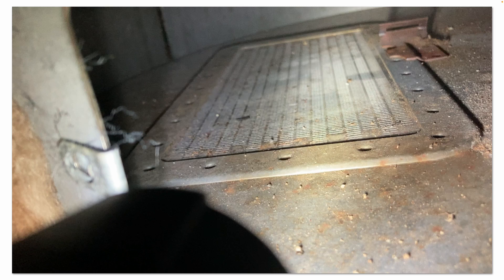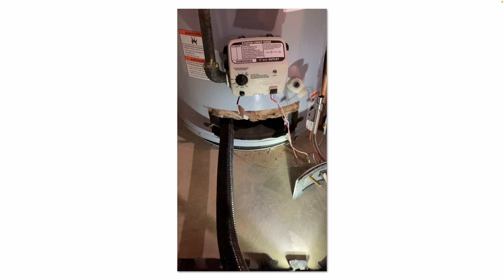If you have inadequate airflow — air comes through that filter that wraps around the bottom of the water heater and comes up through that flame arrester — and if that's plugged with dog hair, dust, debris, etc., you're not going to have proper combustion and the water heater is going to shut down. So gently vacuum that out and blow it out.